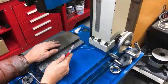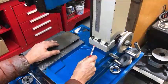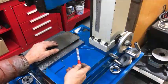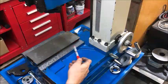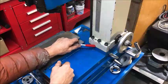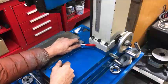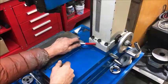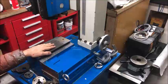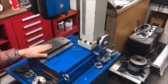It's not much worn, so that shouldn't be a problem. I think if I can use this reference here, or this plane as a reference, hopefully it's also in the same plane as this — indicating from one to another, I could find out. Here I expect wear, while on this one, if it's machined accurately, there should be none. But I don't know if this is accurately machined. I'm not sure if this can be trusted as a reference; I wanted ideally to be using that also, because this is easy when I scrape the ways here, if I know this reference.